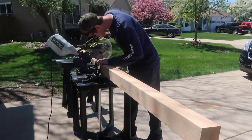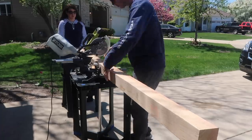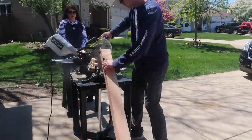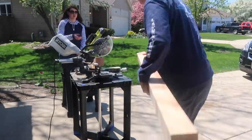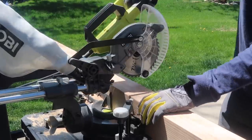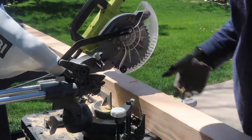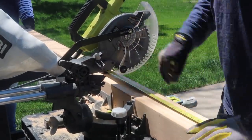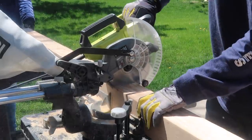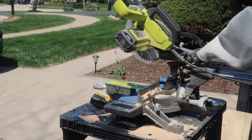Once we got our wood home it was time to start cutting. The first thing Alex cut were these huge 4x4 posts — these are going to be the main pieces of this bed, two anchors of the headboard and two anchors of the footboard. We have a 7.5-inch Ryobi saw so we had to do a little finagling, cutting almost halfway through and then Alex flipped it around. If you've got a 10-inch or bigger saw you'll be fine, but if you have a smaller one you can do it too. Then we made some other cuts for the headboard and footboard.